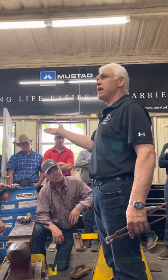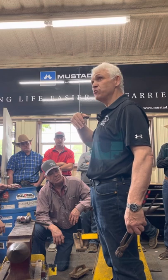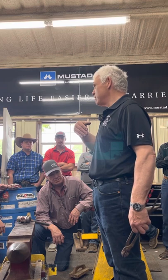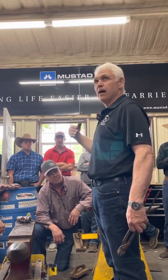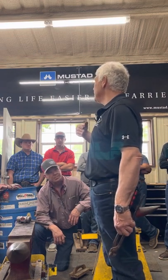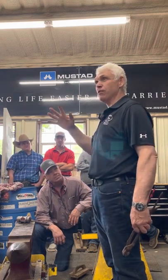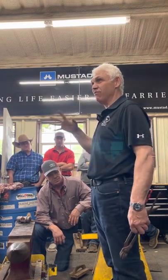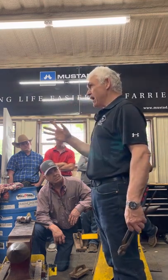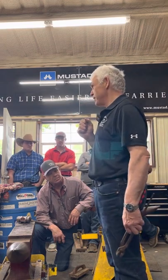If I asked you all to take a shoe off, would I expect you to take a shoe off as good as me? Yes, I hope so. Because why are you good at pulling shoes off? Do it the same way every time. Well, if you've got a lot of variety in your forging, you've probably got a lot of variety in the result. I hem it, I mark it, I full it to 60%, I work the outside edge, I work the garniture, I flatten the hoof side, I flatten the ground side, I full it to 100%. I stamp it, I level it, I stamp it to the anvil, I pritchel it, I level it, I pritchel it. I should get a good result, okay?